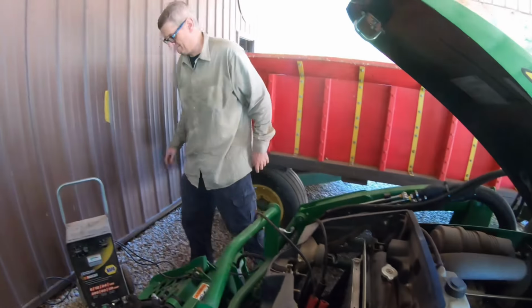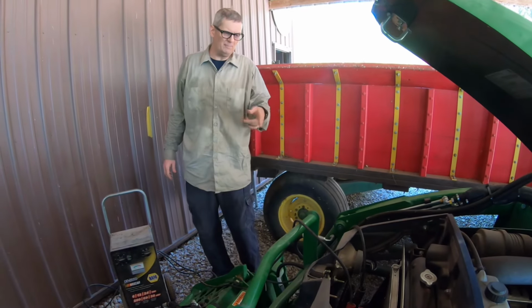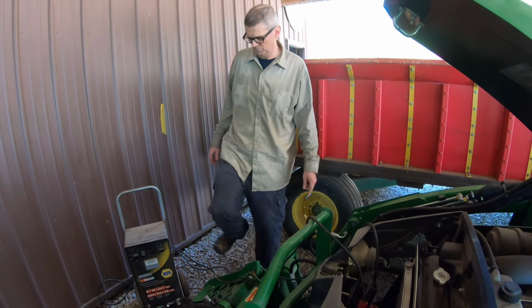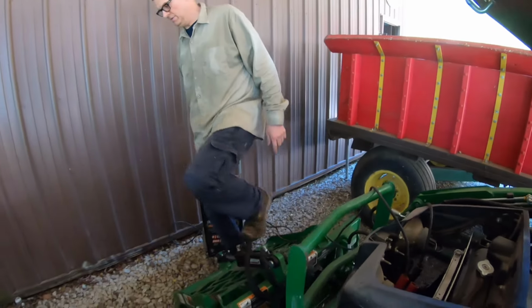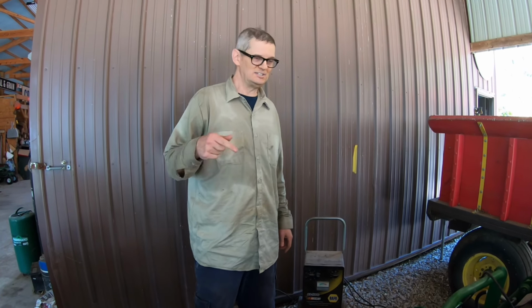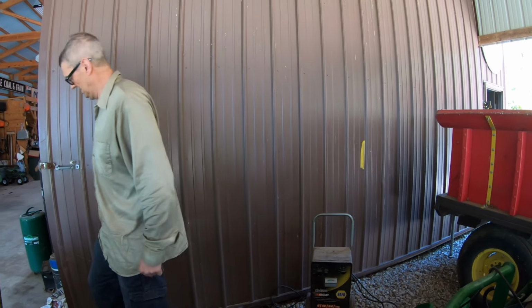Okay, you think maybe you left the lights on? Well, there's that possibility, because that battery was totally dead, or there's a fuse or something blown, because we were getting nothing. But when I had that jumper on there and hit it, it almost at first sounded like maybe the starter's locked up. So we'll take a hammer and tap on that starter next if this doesn't get it.